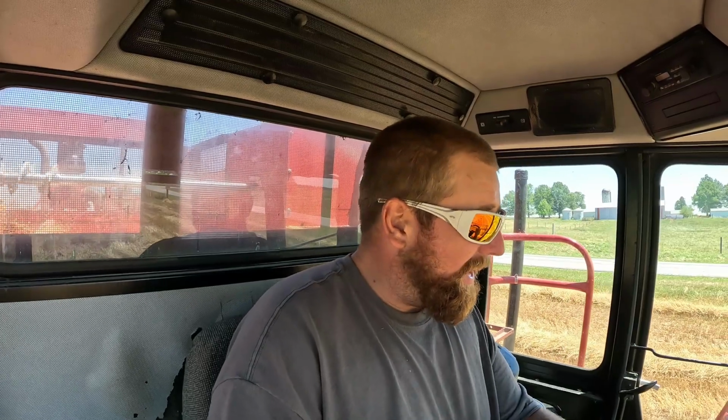Some people say they don't like doing that. There's a lot of loss, they say. The wheat will blow clear out the back of the machine because you're running too much material through. Actually, believe it or not, from what I'm seeing thus far, running this way this year, I think I have less loss than what I had before. I don't know if I just wasn't getting a dense enough mat of crop running through the machine to actually do a good job threshing. It seems to be doing a pretty nice job, so knock on wood. I hope it keeps going good like this.